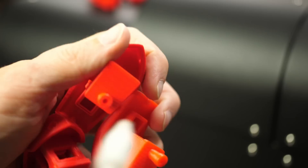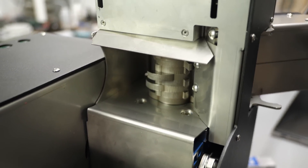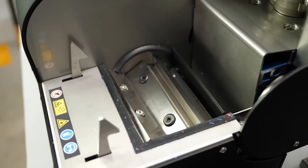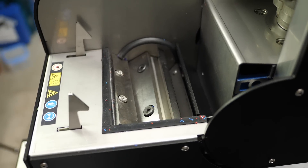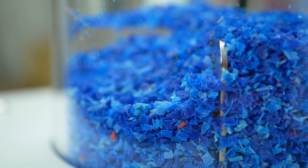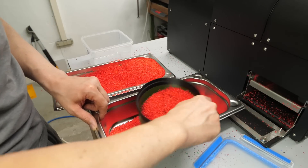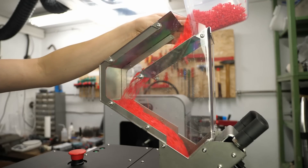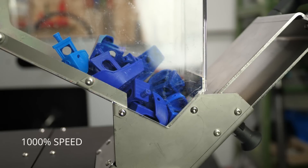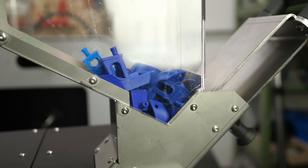In this case, I simply use compressed air for cleaning. The shredder from 3devo combines a conventional shredder that slowly chews through materials and a granulator that uses sharp blades to grind down the smaller chunks as consistently as possible in just one run. Since a consistent and small particle size is very important for the extrusion process, I sieve the regrinds with a mesh size of roughly 3mm and put everything that's still bigger through the machine again. The 3devo shredder is a compact machine and not super fast, so grinding up the 130 3D Benchys took me a good hour.